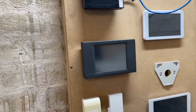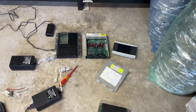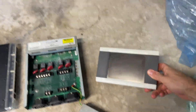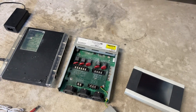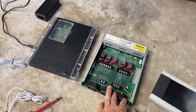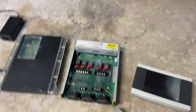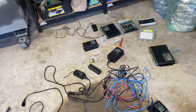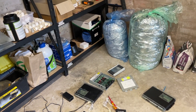In this video I'm going to a house that has a Gen 3 Advantage Air controller. This is all the control gear for that unit — the controller — and you could hardly see it. The display was really bad, and this board is faulty. In this particular video I've replaced all this with a more simple generic style control system, got rid of all this complicated stuff and put in an Actron generic control board with some design switches.